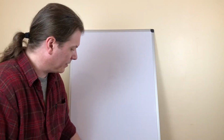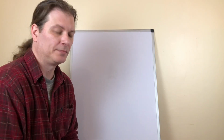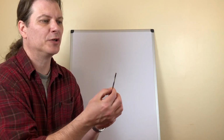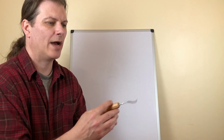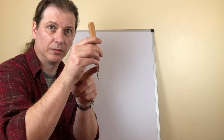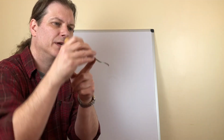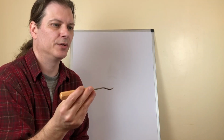Okay, today I'm talking about compound gouge bevels. Here I have what was initially a palm curved number 1. It had a flat edge on it, and it was meant for grounding in places where you need to get a rather steep, higher angle, and just kind of flatten, ground some things. Maybe you need to go in and chop some things in the corner. Not a lot of utility with it.